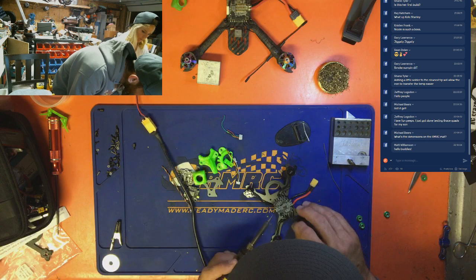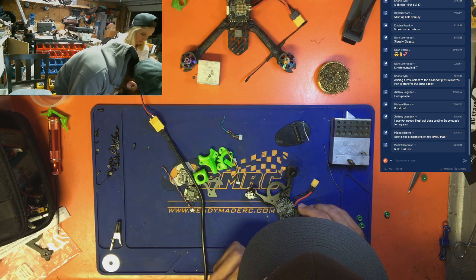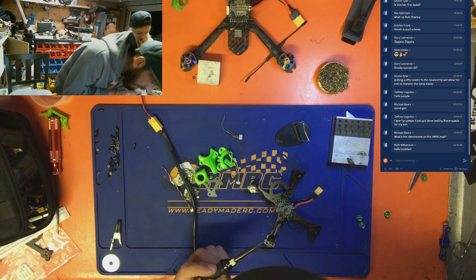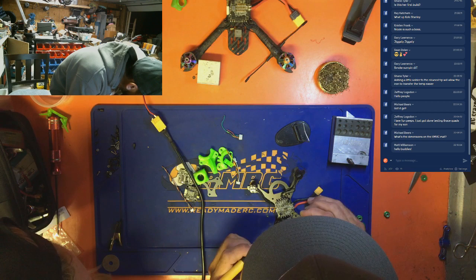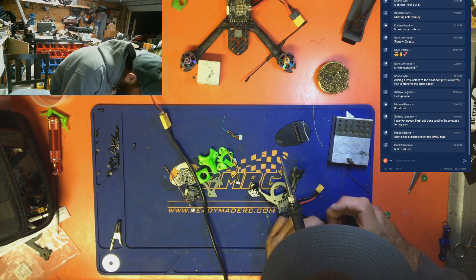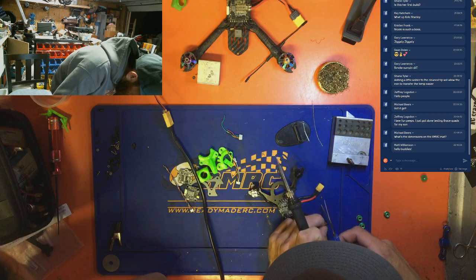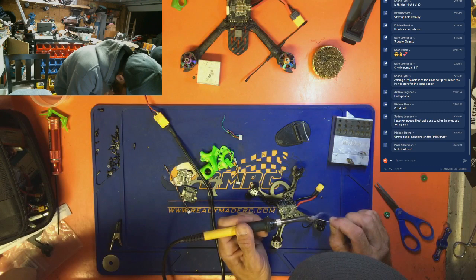Oh yeah, that's a cold solder right there. See how it's kind of like, see how it pulled right off? It's okay. You gotta learn somehow. Probably need a little bit more solder on these. You want to put some more on those ones too before you start. So you just bring in your solder, get yourself a good glob on each one, and stick it on there and get it hot. And this will make it easier to attach them. Let's come back in. I'll let you do. Actually, these things could probably use... Ideally, we'd have some snips. See how all that stuff went flinging? Mm-hmm. That's exactly what you don't want to do.